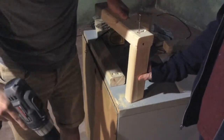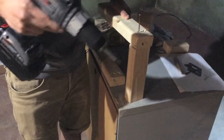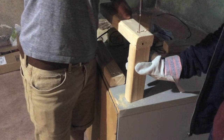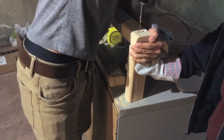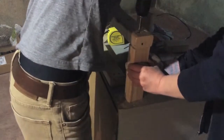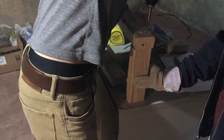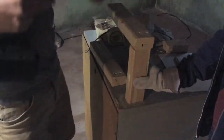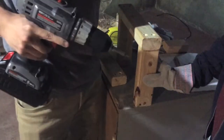I'm using some high quality wood screws — they have a self-driving tip and the head shape is square, so it has better coverage. I don't want a hole in my hand. You are holding a block — take it first. You don't want to shear the thread, so take your time if you have to. Drive it in slowly. Honestly, I love these screws. If you've ever used anything else besides these, you'll know the others are annoying.